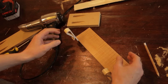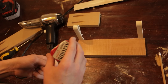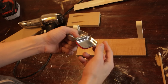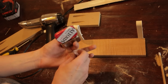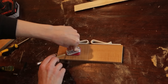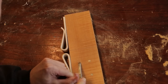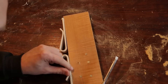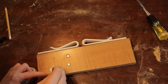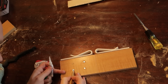It folds, it swivels, it hangs, and honestly I think it slaps. The last thing I wanted to add for the prototype was a little magnetic tray so that I can put kitty treats in there and remove it when it needs cleaning. The top of this Altoids tin seems like the perfect candidate just because it's made out of food safe steel and it'll stick to the magnets but can be wiped clean. I quickly trace out where I want the tray to sit so that I know where to position the magnets. Then using a quarter inch wood chisel, I just carve out some little recesses where the magnets can get glued in. It's probably worth mentioning that using wood tools on MDF will dull the tools very quickly, so I'll take any and all tips you have on working with MDF.